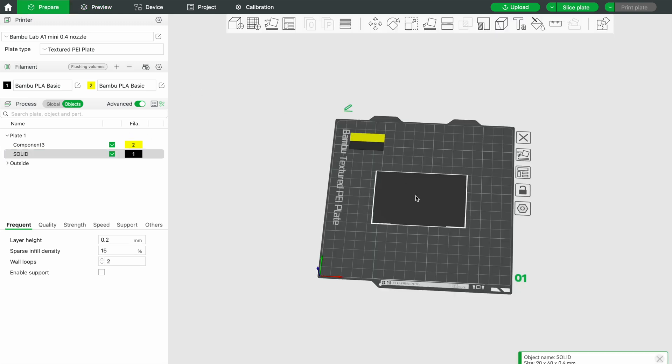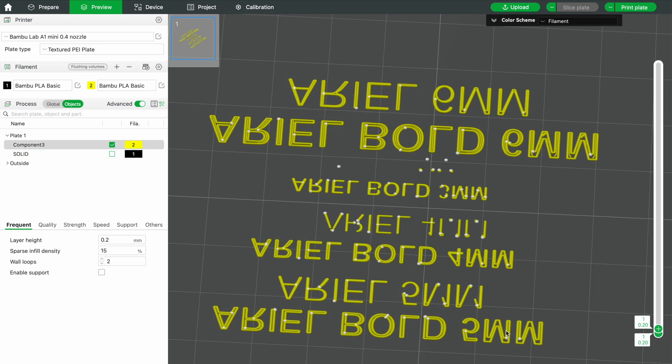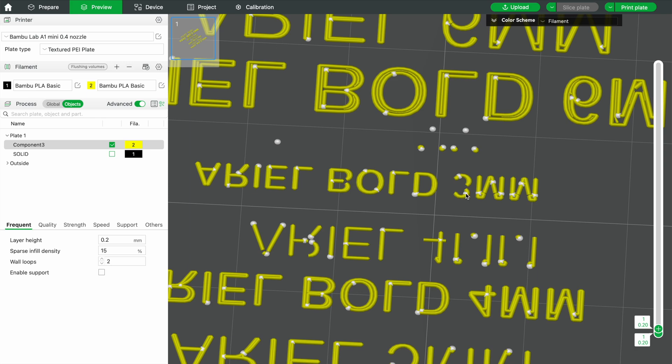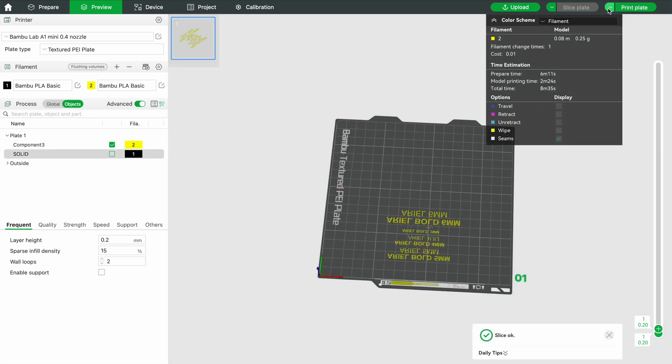If I move the backing plate, you can see the yellow text underneath. I'm going to select both components and slide them to the edge of the build plate so that when the machine homes, it won't accidentally home on some of my letters. If we take a close look at the fonts, the 3mm bold is already losing some characteristics, and the only thing left of the 3mm regular is just a couple of dots. The 3mm bold definitely looks better than the 4mm without bold, so bold is definitely helping. Let's get this thing printed.